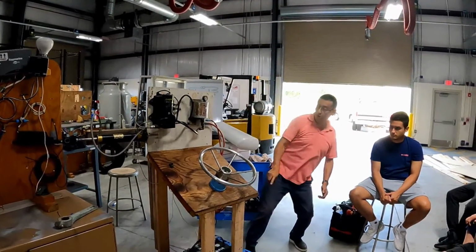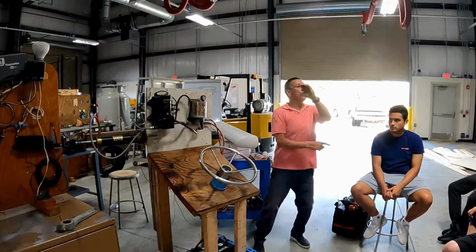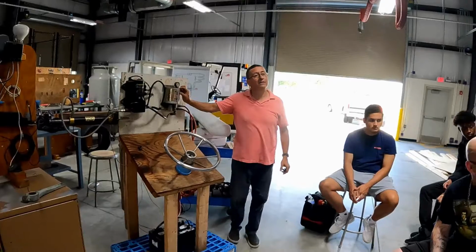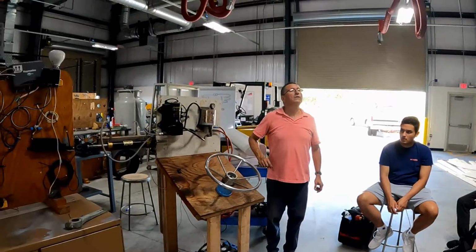When the air moves in the system and goes over there, the air is accumulated over there. The air does not continue mixed with the fluid. With the reservoir, you don't really have to bleed, right? You can bleed here at the reservoir. Yeah, you can bleed it just at the reservoir. All the air just starts flowing up.